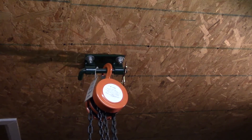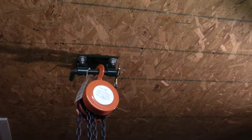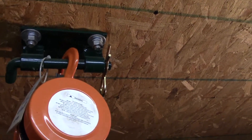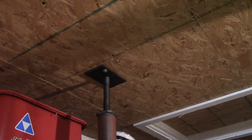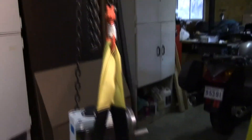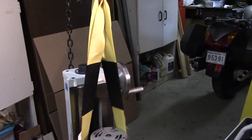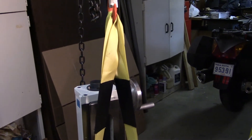It's about 8 inches thick and 8 inches wide, laminated plywood. There's four bolts going up through it, and it basically hooks into this bracket upon which I have the hoist attached. I support the beam from underneath and through the ceiling sheathing with jackposts. On each side, they're spaced about 8 feet apart. I have two straps going around the mill — each one's rated at 500 pounds. The mill itself weighs about 570 pounds, so there's a reasonable safety factor there.